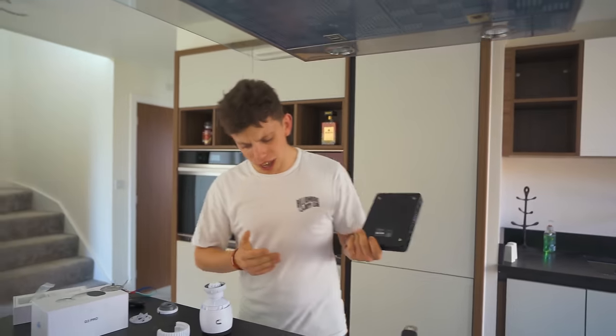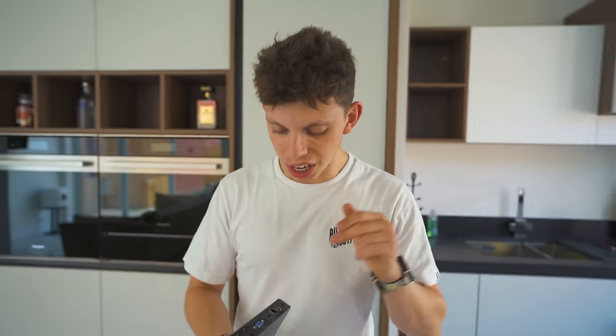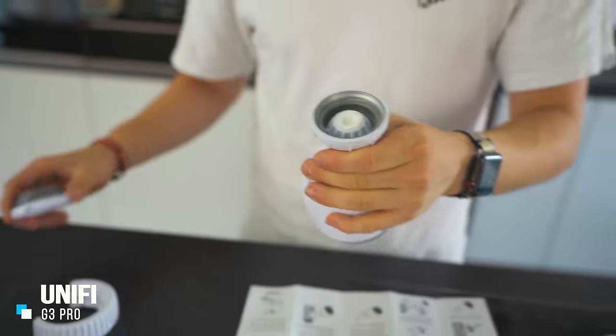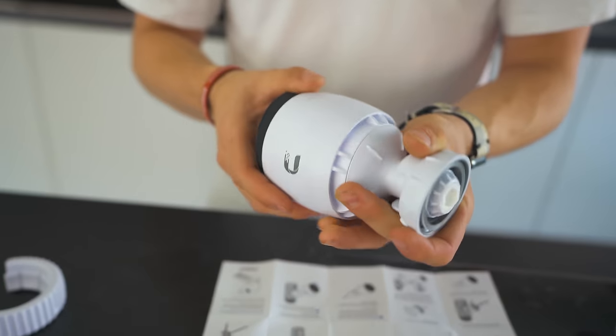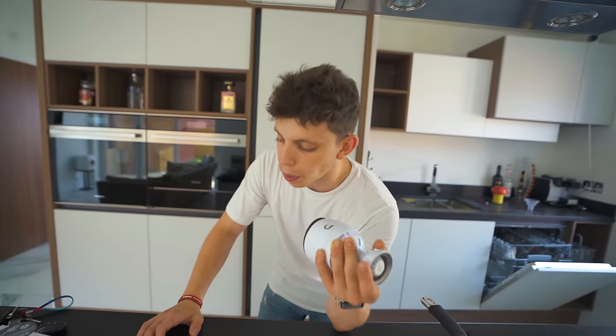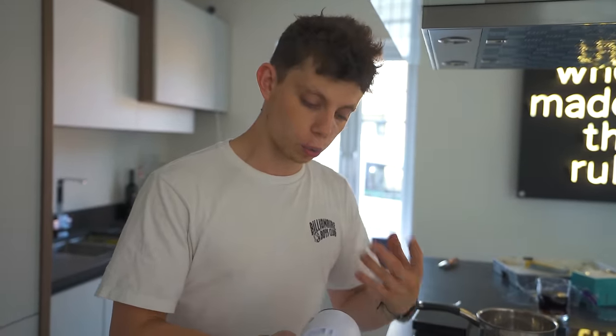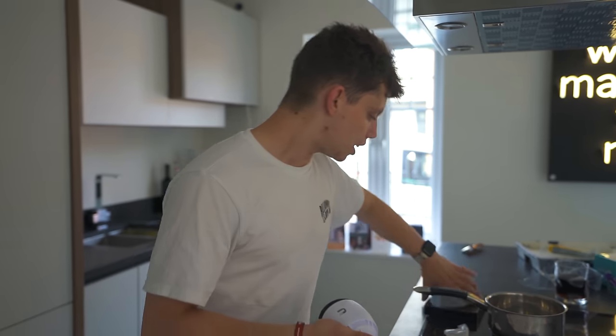I think, much like the NVR — and this is the reason why I love all of these network CCTV systems — because you don't have loads of separate cables running. It's just Ethernet to every single one of the cameras. So the NVR records everything, and you connect the cameras which are these. These are the G3 Pros. They are so, so strong — look at these mounting mechanisms here. They're essentially just connecting via Ethernet and then you plug them into what's called a PoE switch. If you have no idea what a PoE switch is, I'll put part three of where we networked this house in the description. A PoE switch is essentially a network switch but it can also supply power to devices at the same time. So you plug the camera into the switch via one single cable and that's going to travel data and power across that cable. It makes things super, super easy and once you plug in a camera it should just appear in the NVR, at which point you can adopt it and add it to the system. I think this is all meant to be really high quality but also really, really easy.